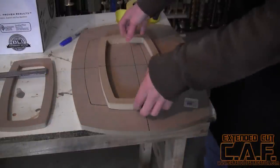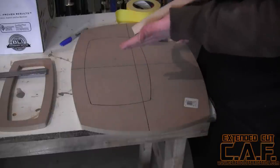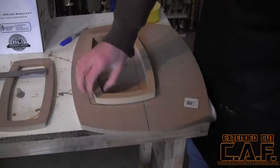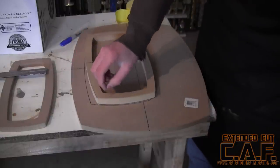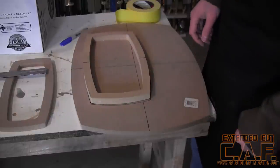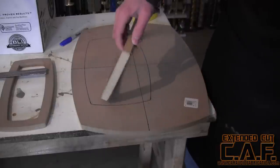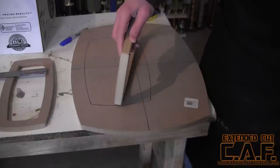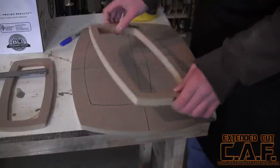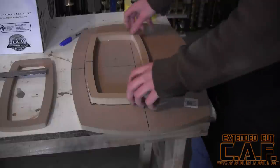Now for this tutorial, I'm going to be doing things a little bit different than what you've seen before. So I have this 3/4 inch thick piece, right? And normally you guys have seen where I'll use the foam tape around here in order to account for that transition gap because it's a 16th inch thick, which is perfect for vinyl on vinyl. But my foam tape is only a 1/2 inch tall. So I'm going to show you guys some awesome router bits that allow me to take off a 32nd of an inch at a time in order to compensate for that.